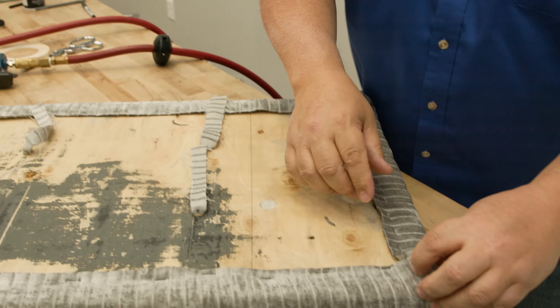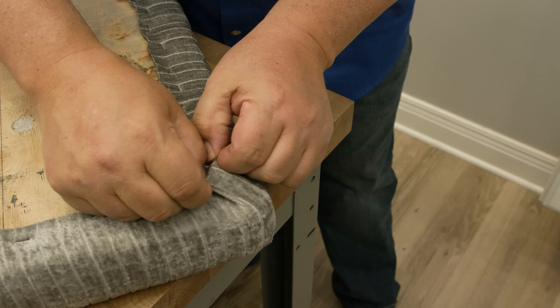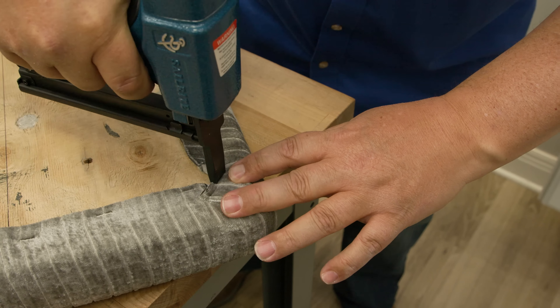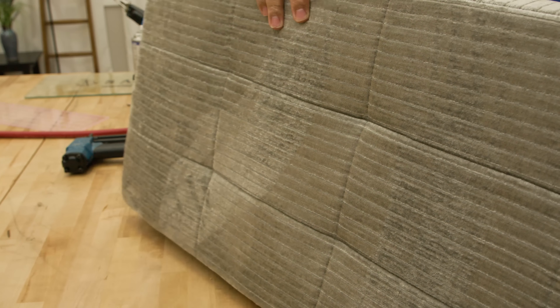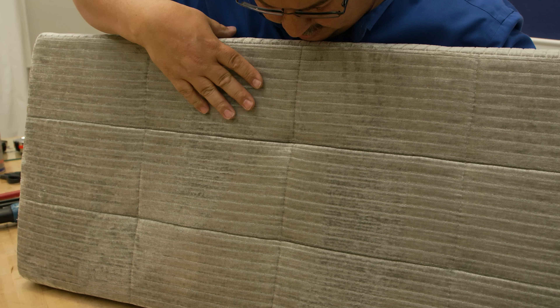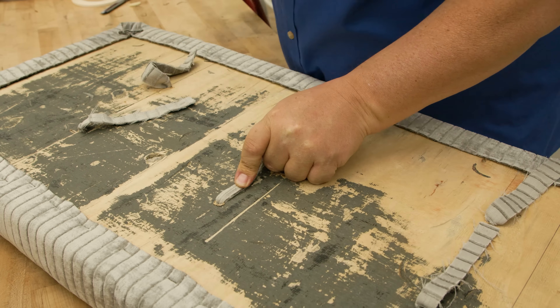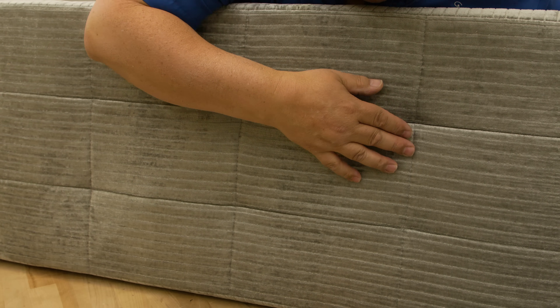For the corner application, once you're happy with everything, butterfly the corner fabric open, pull it fairly taut, and put a couple of staples in. On the back side, we'll start pulling on the poles — notice what it does to the top, creating the indents. You can put as much pressure as you want to get as deep an indent as you'd like. I want them to be fairly similar, so I'll put one staple in at that amount of tension, get them all to about the same divot depth, and then if we need to make adjustments we can pull that staple and redo it.